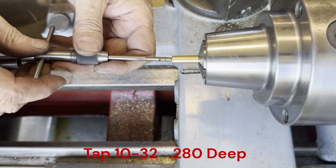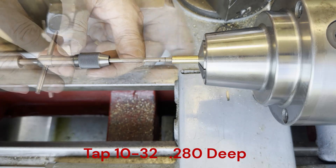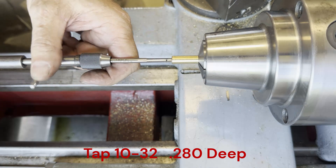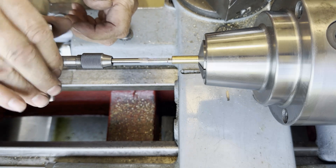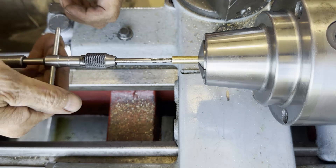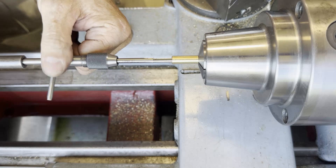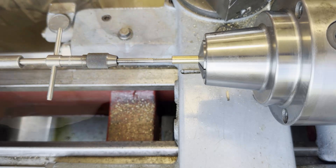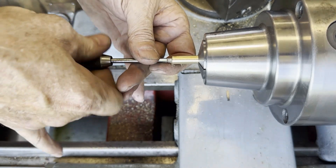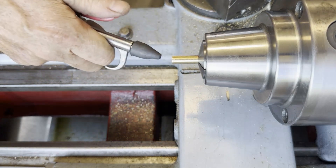This is a little tool I made in the shop — it's a spring-loaded tap guide — and it keeps the tap lined up straight. As you can see, I put a little tension on it as I brought the tailstock forward. We'll tap this 10-32, which is the thread size, and you can see my Sharpie marks on the tap so I can see how deep I need to go. There are several marks on there from previous projects, but it's that shortest depth that we want.